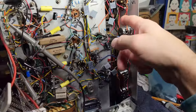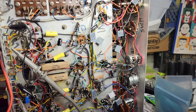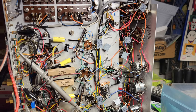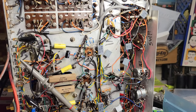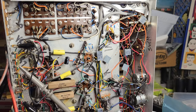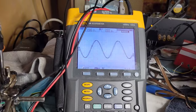What was the one thing I was thinking, oh yeah, I'd like to replace those capacitors. They're 0.015 microfarad or 15 nanofarad, and I don't have any of those. I could put together some 0.01s and some 0.0047s, but that's like double the cost of putting in the right value. So I'll order the right value and maybe replace those when I get around to it. Yeah, pretty nice.